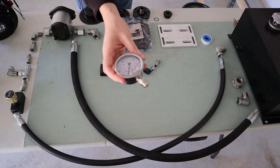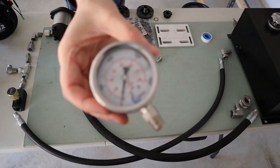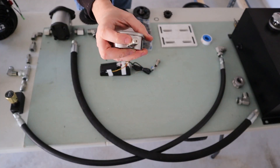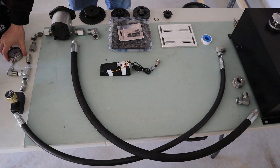The union T goes into an elbow adapter that brings a 1/2-inch male down to a 1/4-inch female, and that goes into my gauge. The pressure gauge is a 2.5-inch liquid-filled gauge, zero to 2,000 PSI, with a 1/4-inch NPT mount. I got that off of Amazon for about $10.